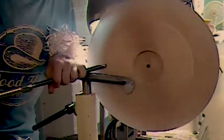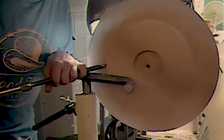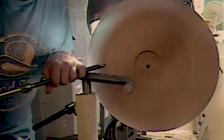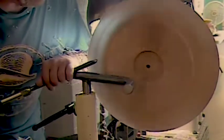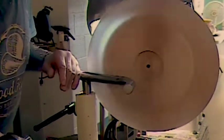I put my head right over the brim and can put one eyeball on the brim part and another eyeball on the tool, and I can see I'm still 3/8 of an inch thick right there. It's a nice, encouraging feeling to keep going without having to stop and measure. And the sound changes when it gets thin. It goes from real high pitched, like a squirrel sound.